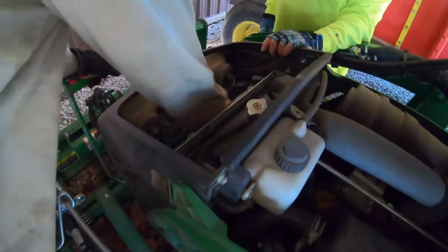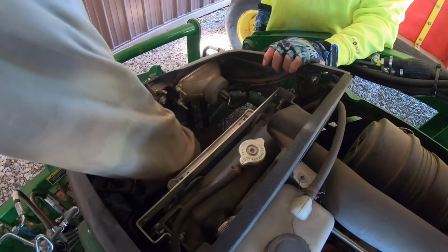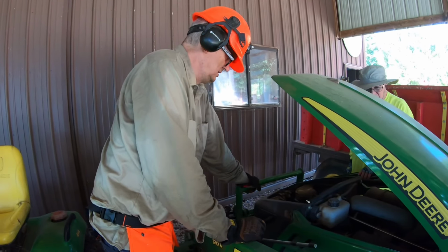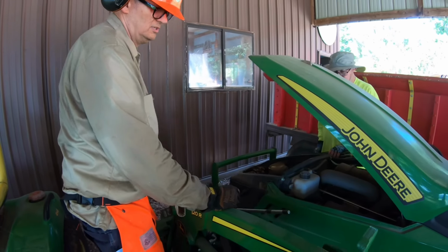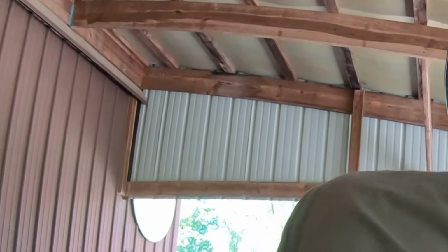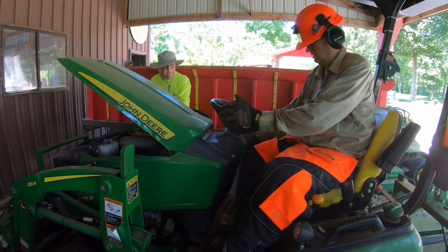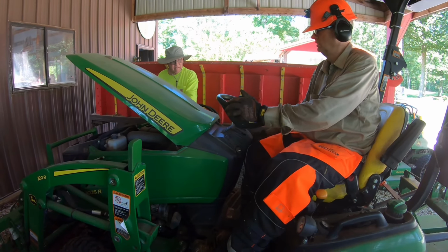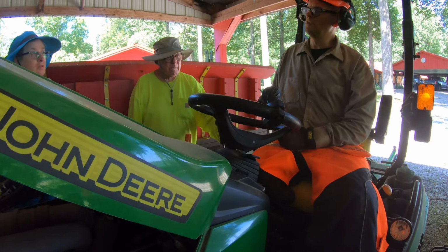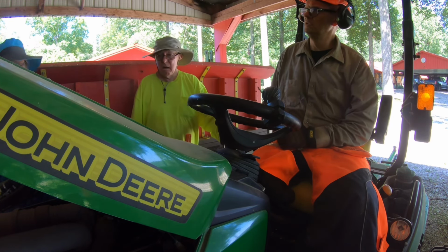Nope, ground ain't loose. Okay. The grounds are good. And when the battery came up, it looked like it was good. So we'll see what we got. I had this same kind of issue with my key switch. You think it's another key switch thing? Might be another key switch thing. I think we should try a jumper first. Okay. Do you want to go get one of our jump boxes? Yeah. Either one of them would be great.